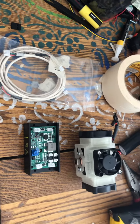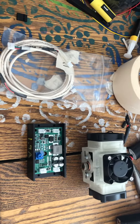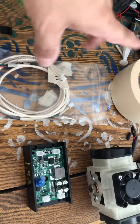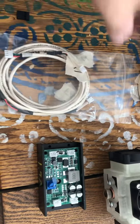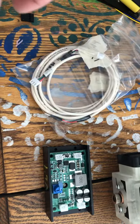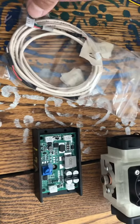I'm making this video as a quick way to introduce you to how most of my kits come. We have our main wiring harness, we have the short one that goes from the board to the driver, and then from the output of the driver to the laser module. I use XH 2.54 millimeter connections and Dupont connectors. Everything I usually do is orientated so that you can only set it up one way.